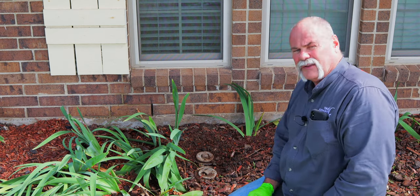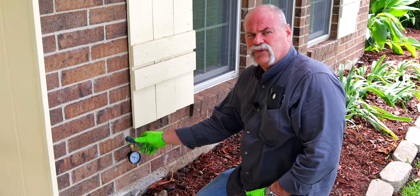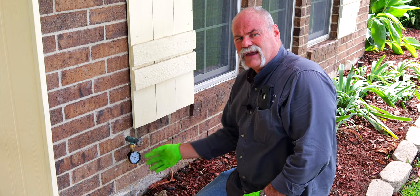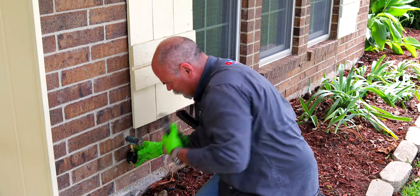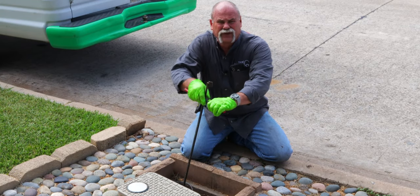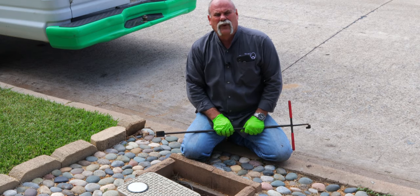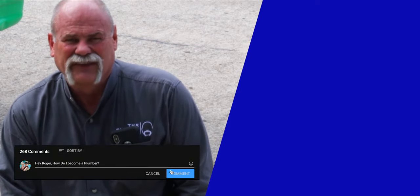Now that we're done we've pulled the test ball out, got the lids put back on, and straightened everything up. Remember, always leave it as well as you found it. The gauge held so we don't have any problems. I'll shut the hose bib off, undo the gauge, and turn the water back on. Make sure you do that part — I once sent a plumber out to do a sewer and water test and got a call from the homeowner later saying they had no water because he forgot to turn it back on. Make sure you finish every single step. I'm Roger Wakefield, Lead AP, the expert plumber — I'll see you on the next video if you don't get flushed.